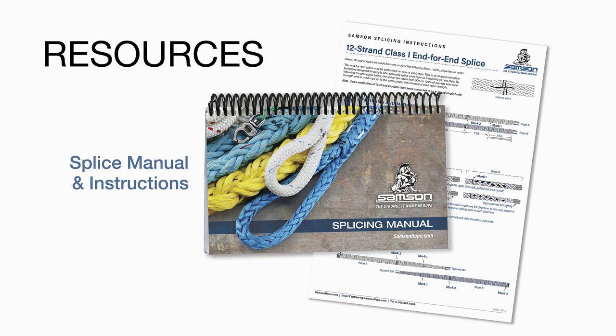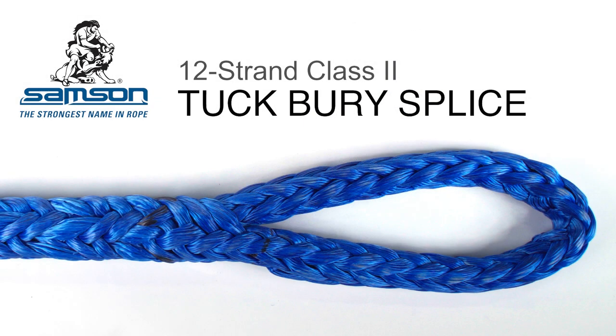The eye splice is used to form a permanent eye or loop in the end of the rope for attachment to a fixed point like a cleat or mooring bollard. An eye is also used to form the rope around a thimble to protect the rope when attaching to a shackle, chain, or wire rope. Eye-to-eye splices can also be used to join two ropes.